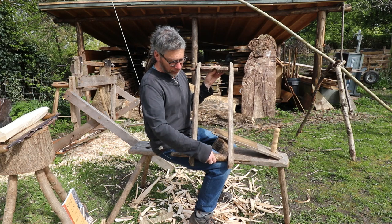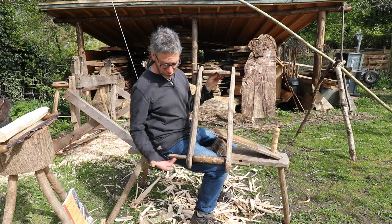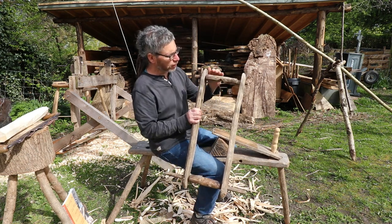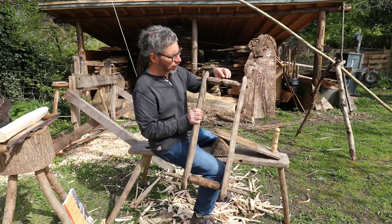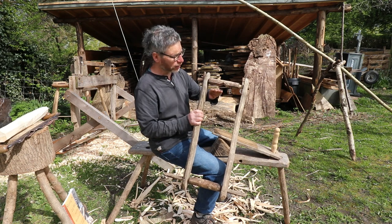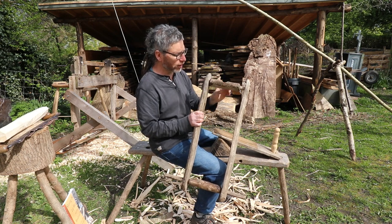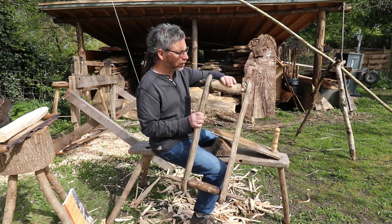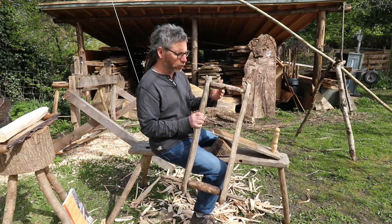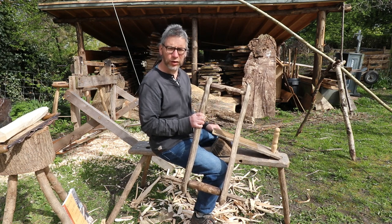At the bottom this is a bit of branch wood, and the sides are turned so you've got a nice long distance there to rest your foot. At the top we've got the clamping bit — round pegs coming out, but flat on this side just done with an axe, which gives you more surface area to clamp. If you want a bit more pressure you can turn it round and then you've got a point of pressure. We've also cut out an angle here so that a piece of wood fitting in there gives you a more secure clamp.